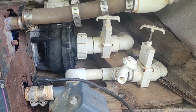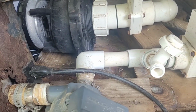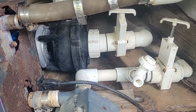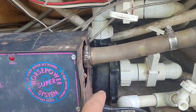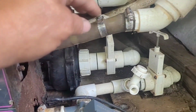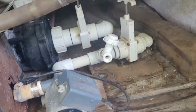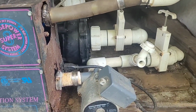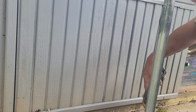But okay, we're going to move on here. Let me get this stuff buttoned up. You've got to tighten your drain plugs down at the bottom too, because the drain plugs have been loosened. In the bottom of the pump motors, there's the drain plug. So I loosened all those, we'll have to tighten those back up. All right, so I got this one reattached. That one's tight. Made sure I shut off my spigot. This pump one is not tight, so we'll do that real quick, and then we're gonna jump over to the other side. Let's pop this side off real quick.